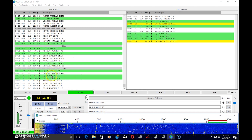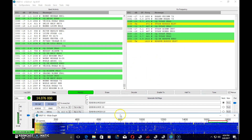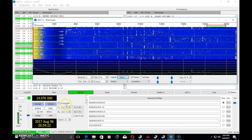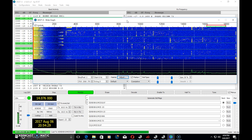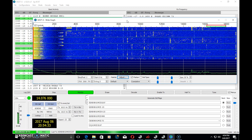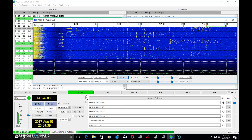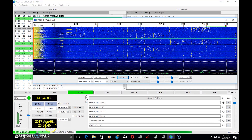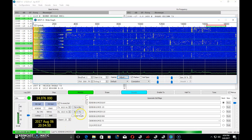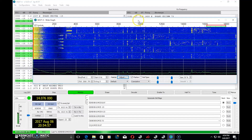When you're transmitting, other people are transmitting at the same time. You can be on an odd or even minute — meaning if I'm decoding everybody else's transmissions, when I transmit I'm transmitting with a lot of people simultaneously. You can be on the first or second minute so you're not transmitting at the same time others are transmitting. If I'm two seconds wrong on my clock, I'll start transmitting two seconds late — losing part of the information and it won't be a complete contact.